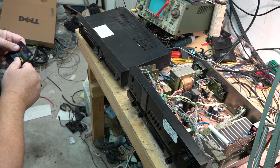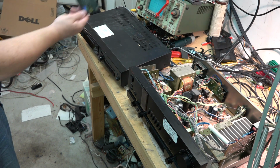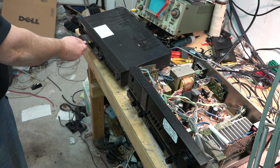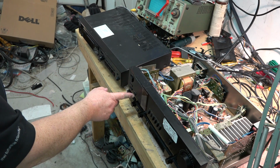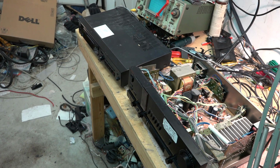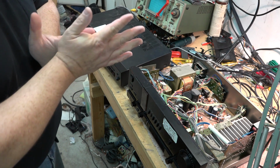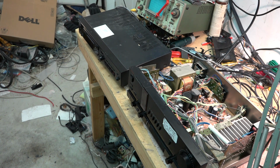So here we've got the good old mini disc machine hooked up. I've got my mini disc of royalty-free music, and we'll just turn on the amplifier. I'm first going to turn on the preheat switch and let the tubes warm up for a minute or two before turning on the power. It's always a good idea when you're dealing with vacuum tubes that you heat up the filaments a bit. So we'll leave this thing going for a few minutes here before I turn on the power.